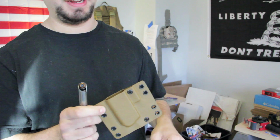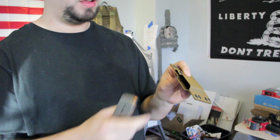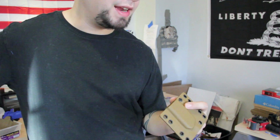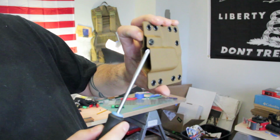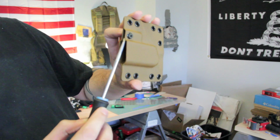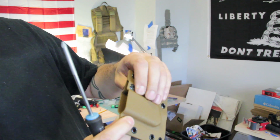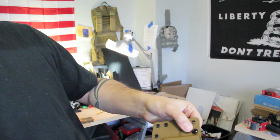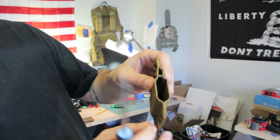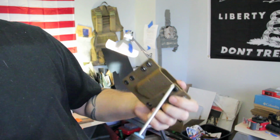So here we go, it's all riveted together. I want to show you the construction that I used to set this up. I have a Phillips head screw in the front. I have an unflared rivet inside so that you can't conceivably press it down to the point where you start to crack things. The rivet itself will bottom out against the back face of the Kydex. And then I just have the back end of the Chicago screw here with a little O-ring in it.